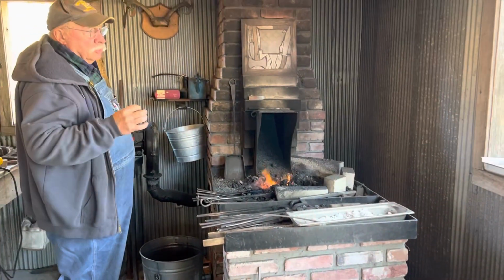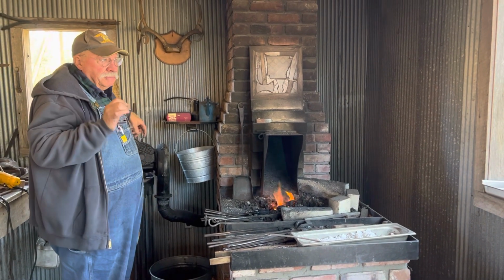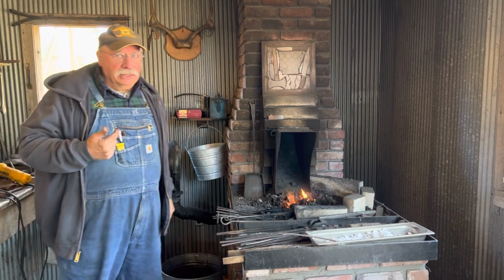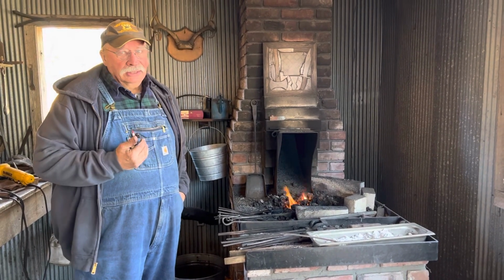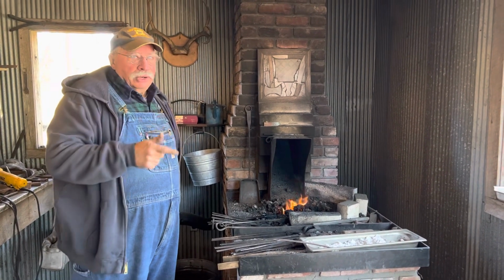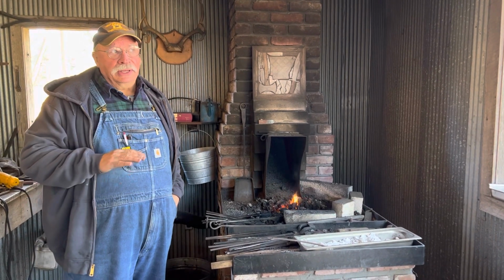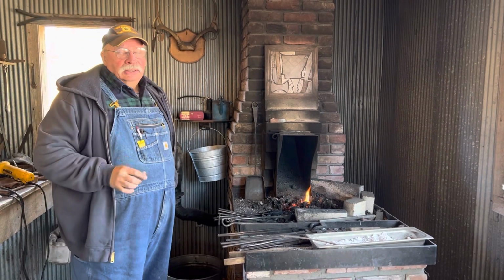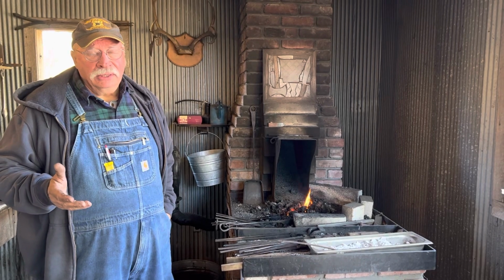We started with 1/4 inch stock, 1/4 inch thick. Keep in mind that that is, for me, too thick for a knife blade. So I'm not expecting to just put a point on this and grind it and it's 1/4 inch thick at the spine. I'd prefer not to have something like that. I want a thinner blade, 1/8, maybe 1/8 inch thick.